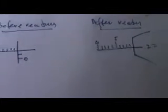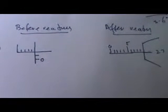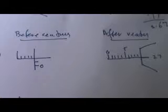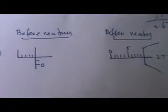Now let us do the last one. I will count to three, then you stop it, answer the question, then play it again. Now let us answer the question. It is zero one, zero one, two, three, four — you can see here there is zero error, it is one down. When it is one down: if it is three down, we minus point zero three; if it is one down, we minus point zero one. So it is one down, we minus point zero one. The answer is five, six, seven, eight, nine, nine point twenty seven. Nine point twenty seven minus point zero one becomes nine point twenty six.